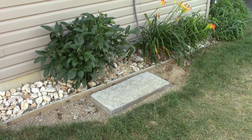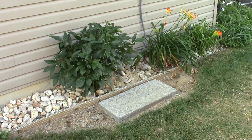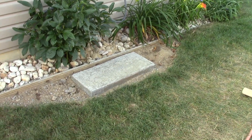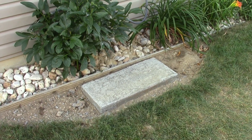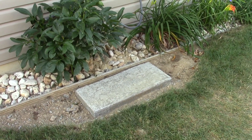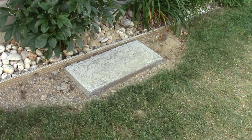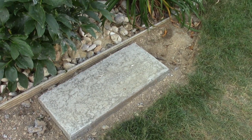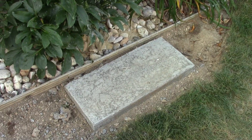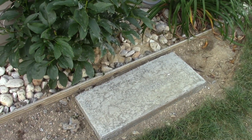Here's a look at the slab I poured for the outdoor unit. I poured it because I didn't want to mount the unit on the house. It only cost about eight bucks and was easy to do — I'll put a link in the description to a video showing how to pour a little slab like this. That should reduce noise and vibration, and now we're going to set the outdoor compressor on that slab.